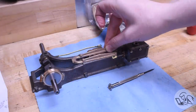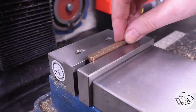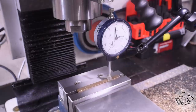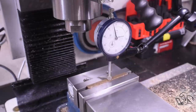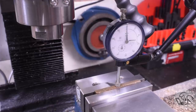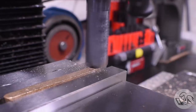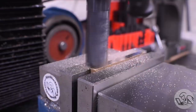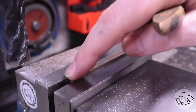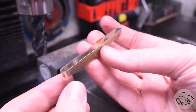I cut these sprues off and I'm going to try setting it up just gripping the edge of the casting, because we don't have much work to do here. All I really need to do is get it mostly level in the vise, so I'm tapping the high end until it's flat to within a couple of thousandths - within the imperfections of the casting. Then I can machine the bottom. The grip on this casting edge isn't great, but I only need one very light pass. There are no dimensions here - I just need a decent finish so the crosshead will slide on that surface.